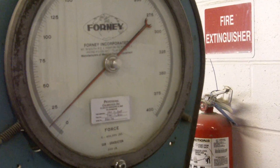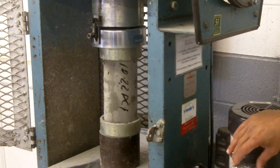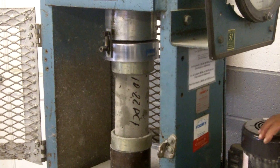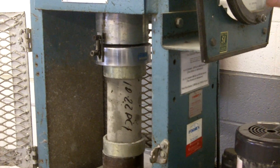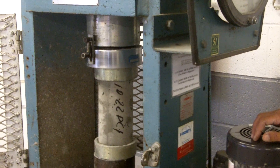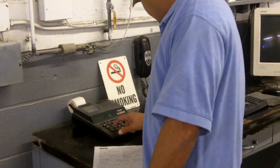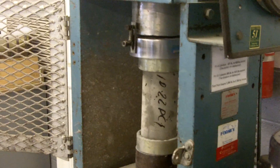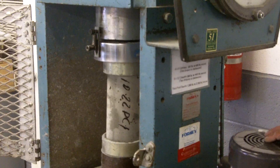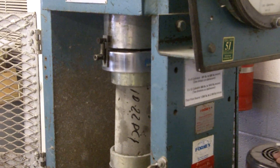So where are we at right now? We're coming up on 15,000. When this gets up to 2,000 PSI, we're guessing it's going to start cracking. Yeah, you'll see it being crushed. This machine compared to a digital readout — that's a lot easier to read. This is an older machine; you need good eyes to read this. We're at 25,000 now, close to 30,000 — that's over 2,300 PSI. His guess was 2,000 PSI for when it would start busting apart. We're steadily climbing — it'll start breaking off. Here's some cracking, some crumbling.